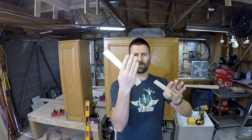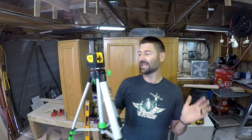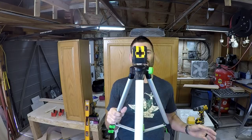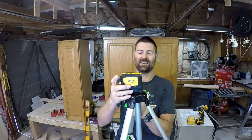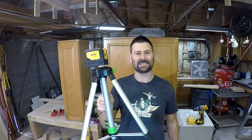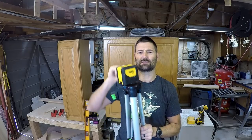A few more things: wood shims. These make getting your cabinets perfectly plumb and help you get everything in the precise position. The last tool that makes installing cabinets super easy is a self-leveling laser. Is it necessary? I've installed more kitchen cabinets without a laser than with one, but it makes things super easy. This one here I think is under $100. I'll look it up and put links to all these tools in the description below.